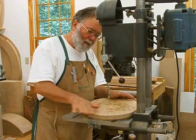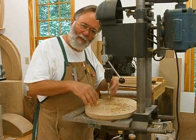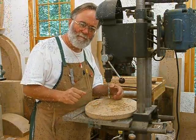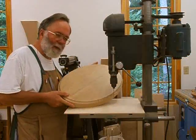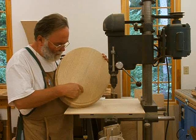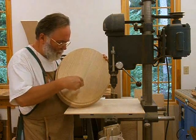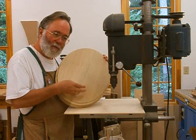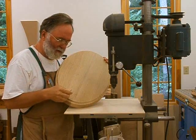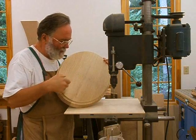All the holes in the bottom of the top platform are ready to be doweled into the pedestal. Now I'm going to screw the base to the bottom of the pedestal. I've marked seven holes — three on the end that is the outside of the cantilever, since this thing is tilted, and then the rest.